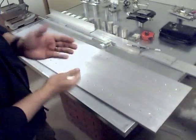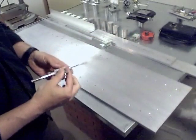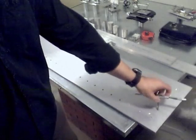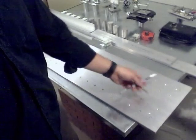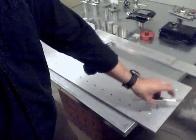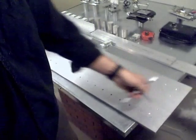The holes are a quarter inch and once they've been drilled, they have to be threaded. That can be done simply with a typical threading tool. Because it's aluminum, it's fairly easy to thread by hand — you just put the threading tool into the hole, turn it around several times until you go through to the bottom, pull it back out, and you do that for every hole.